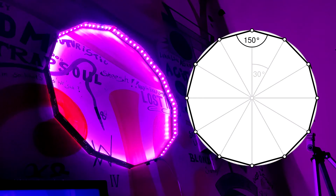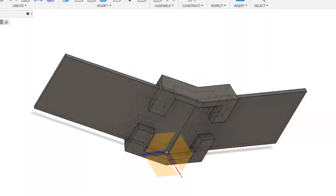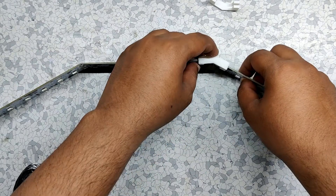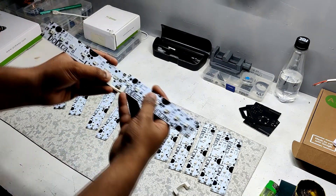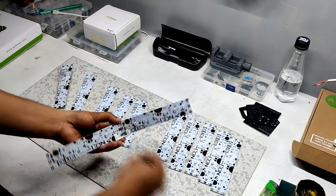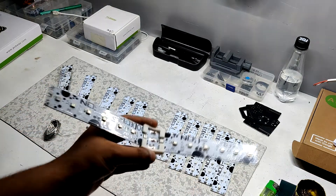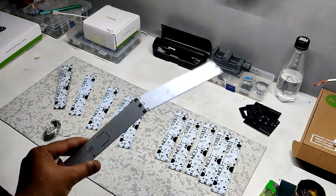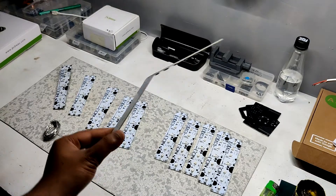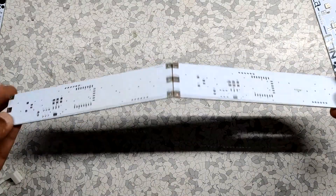The dodecagon shape has 12 sides and the internal angle between two sides is 150 degrees. To solder this setup at a proper 150-degree angle, I modeled a jig in Fusion 360 which holds two PCBs at exactly 150 degrees. By putting the jig on both sides of two PCBs, we can securely connect them and solder them by adding solder wire between their two soldering pads. This whole assembly process involves putting two PCBs together and connecting them by soldering their pads. No glue is required — the PCBs are held in place by solder joints.